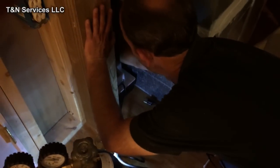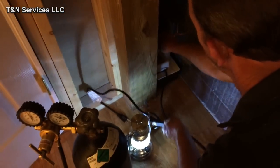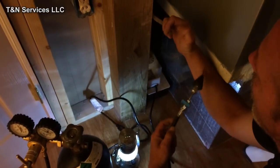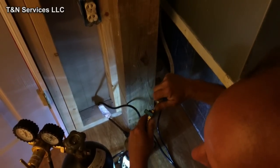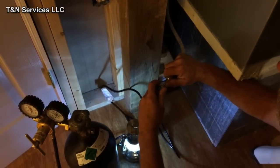I'm down here at the pump and I'm going to disconnect it. I'm gonna hook the end of my hose up right there and blow it out. The pump is unplugged — see right here, it's unplugged. What I'm gonna do is take the drain line, the little clear condensate tube that attaches to the pump, and stick my little cone inside of it. I've already got my nitrogen on right here, so I'm just going to blow it out.